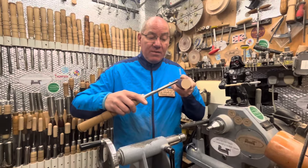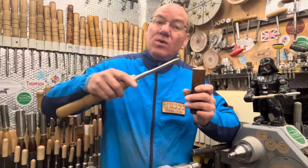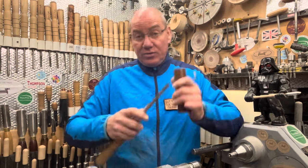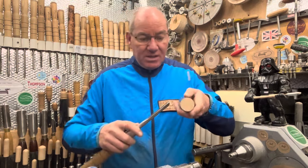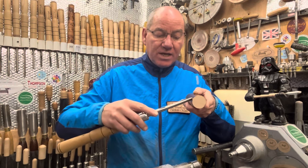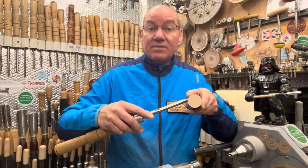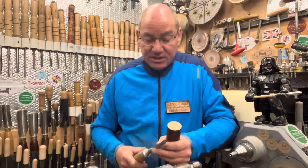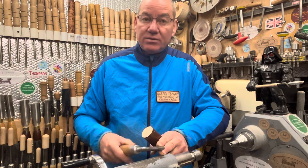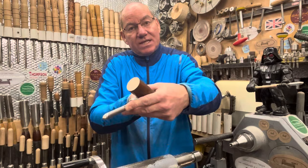So then I'm on heel and toe, so of course it's going to make it very aggressive and very twitchy. If I come in and try to make the cut like this, I'm not going to get the proper bevel support. It's always going to want to go a bit deeper and it could be a little bit grabby. You'll get used to it, and people do. But for me, I like to come in with my flute open and then rotate. If I'm there, that can be rubbing the bevel. The minute I rotate, that's the cut. So for me, the cut is not raising the handle, it's a rotate. It's off and on, and that's it. That picks up the cut, and then I move, and then I raise the handle.